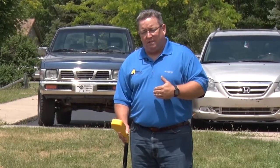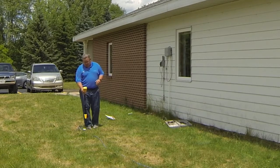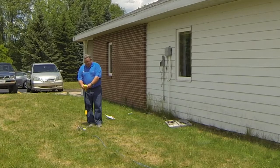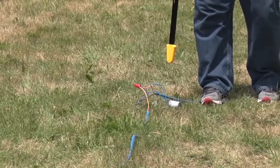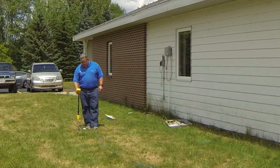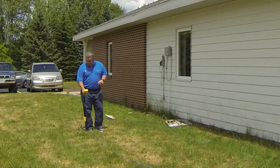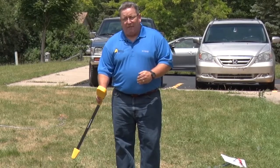As I go through, I'm marking where I've been so I can turn around and see where I've been. But as I go across, that number is going to move. As I go across the decoder, it's getting louder — I can see a number that's jumping. So I'm going to back off of that decoder and go to peak mode. Turn the unit down as low as I can to get a reading. Going straight over the path of wire, it's reading 33. As I go across the path, it's reading up to 44, and now it goes back down to 33. That higher reading is telling me there's something there. It could be just a good splice too — you might pick up splices that aren't marked. So going back to null mode, we found that decoder.